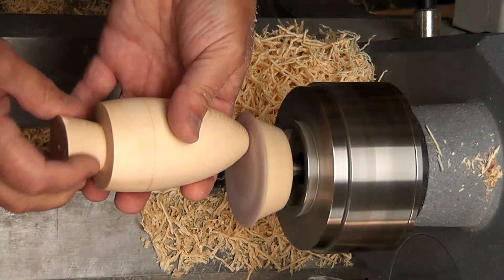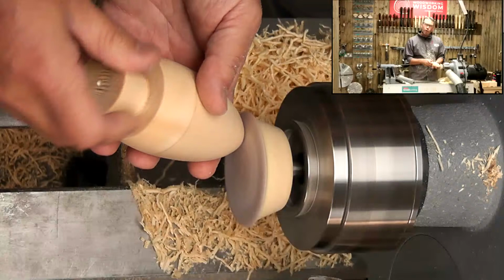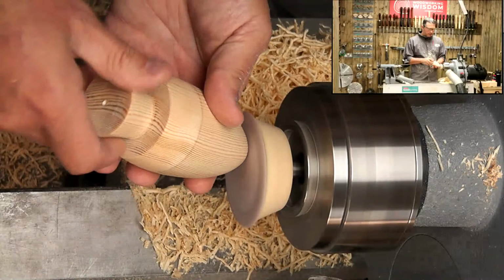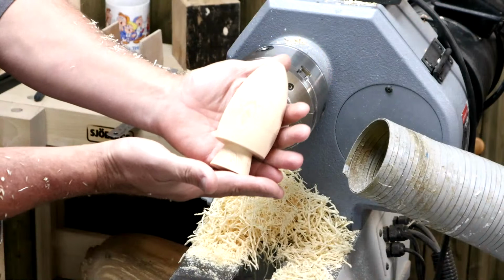And you're not going to put loads of facets on the end. If you use like a 240 grit or 180, then you'll sand facets on there. But a 400 grit is fine enough to get rid of the marks without leaving sanding facets. So there we are, that's it. You'll need to do however many you want to put on your mobile, 4, 5, 6, whatever. And that would be our first rocket shape done.